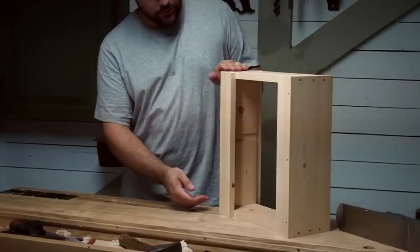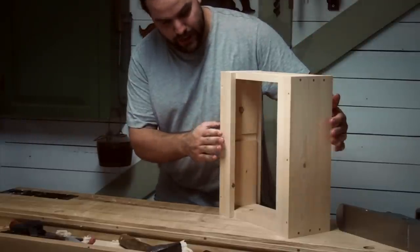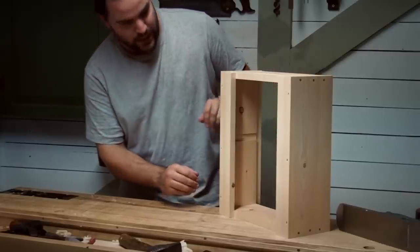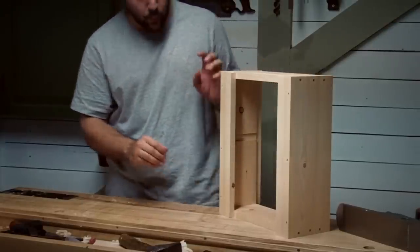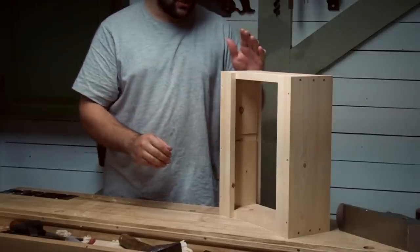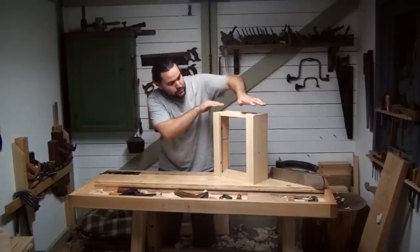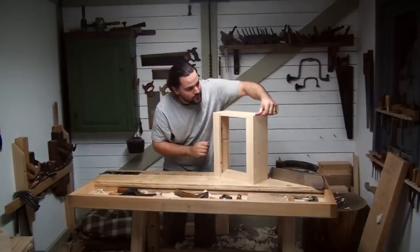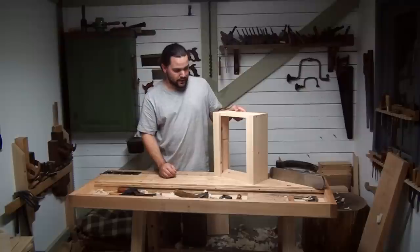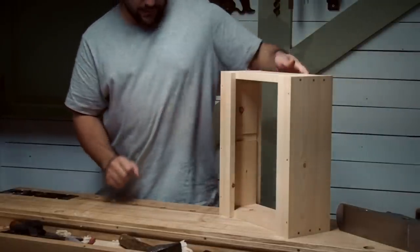Everything's now cleaned up — the tops and bottoms are all levelled off and everything's smooth. With the sides and the face frame I was aiming for the best finish I could possibly get: no tear-out or plane tracks left in them, because even though we're painting it, it will show up. The top I wasn't really that fussed about the finish; however what I did do was just slightly dish them. That means when we put our top and bottom caps on we're going to end up with a very tight seam all the way around. We're now going to have to change our way of working — now it's cleaned up we don't want to have to clean it up again, so we're going to start respecting it a little bit more.